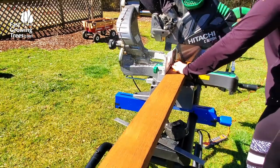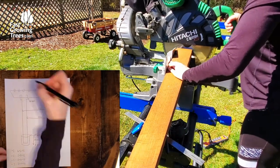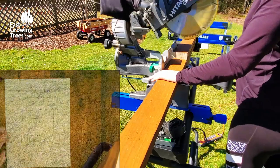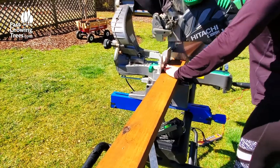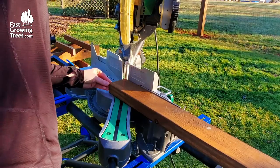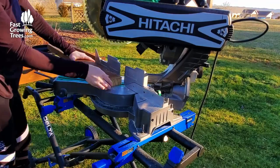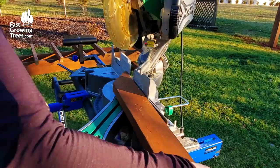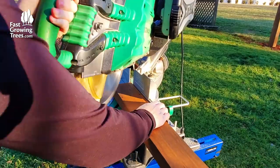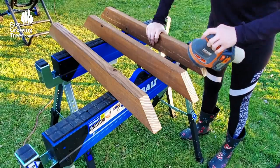Now it's time to start cutting and preparing all the wood pieces needed. Both 16-foot 2x4s were first stained and dried prior to cutting. To create the 10 rafters used on top of the structure to construct a mini pergola for my grapevines, both 16-foot 2x4s are cut evenly into five 3-foot rafters each, for a total of 10. I then set my miter saw at 45 degrees and cut an angle at each end of the rafters. They are then sanded to round off the ends.